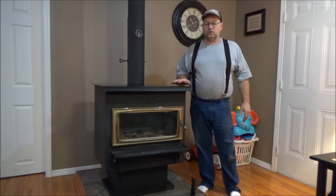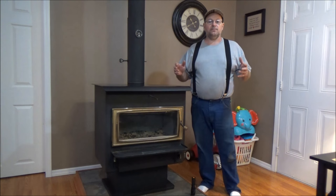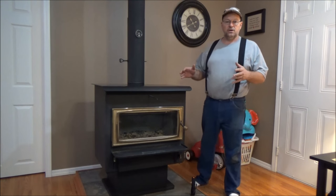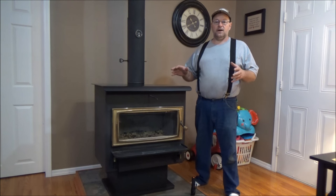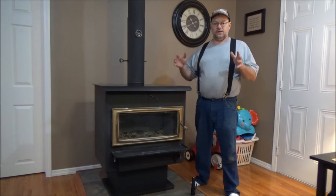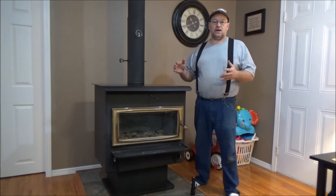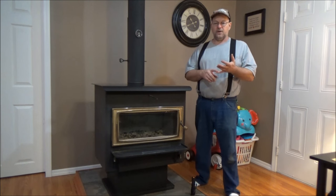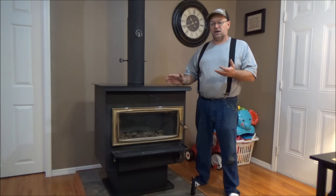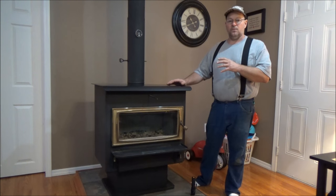When you go to look for a wood burner, you want to look for one that has a blower on it. You don't want something like a potbelly stove. If you're going to be putting this in your house, you want to make sure the stove is airtight — meaning it has a gasket around the door and around the ash pit. You want to be able to shut the stove down so if it gets out of control, it's not going to make any more heat. Gaskets are what you're looking for. Not a Franklin stove, not a potbelly stove. You want something with a blower if you can get it — a sealed tight container, not cast iron. I'm going to show you a little bit more about my stove and what I look for.